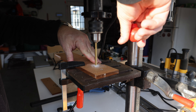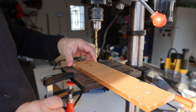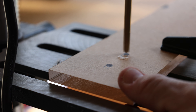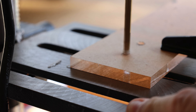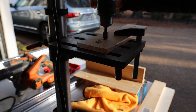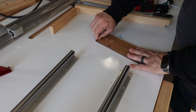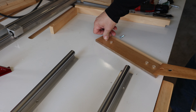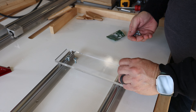Now it's time to take our hole saw and cut a hole in the middle where the router bit is going to go through. This is a two-and-a-half-inch hole. We started with a pilot hole right through the middle on the drill press, then took the hole saw and cut halfway through, flipped it over, and cut the rest of the way. That prevented anything from chipping or having tear-out. It took a little bit of sandpaper to smooth things out, but this turned out way better than expected.